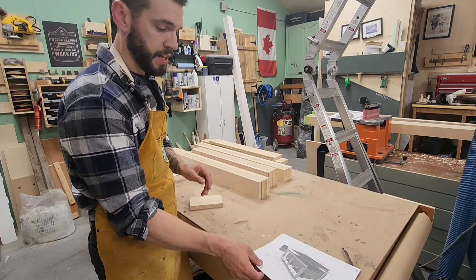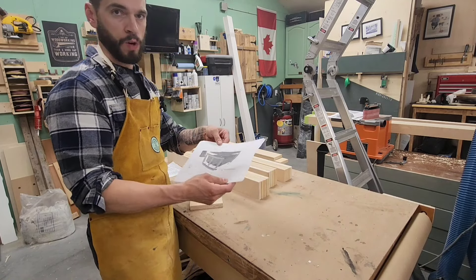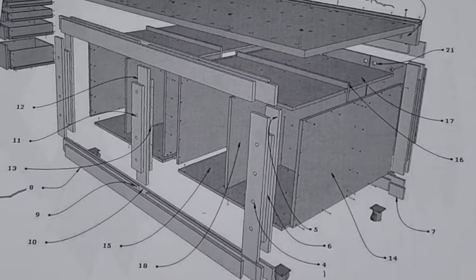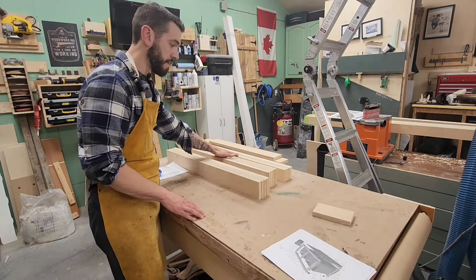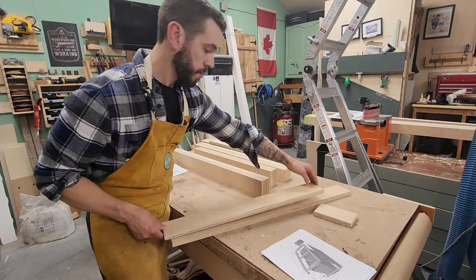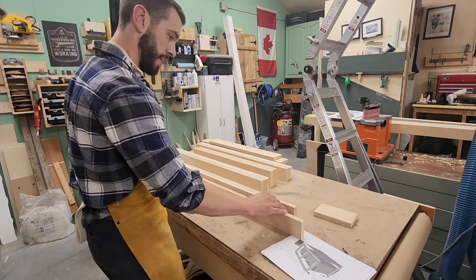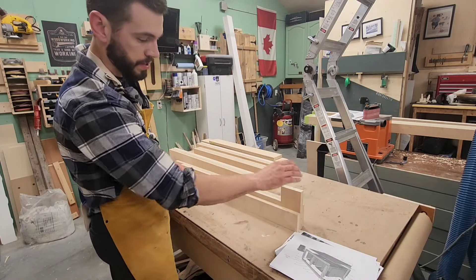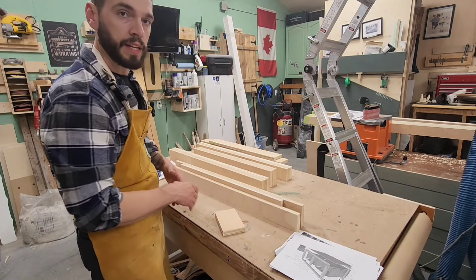So this workbench is not actually my exact design — it's actually from Suso over at ES Woodworking; I'll put a link in the description. I'm going with his workbench design, which is basically built up of material as opposed to taking material away. What you just watched me cut was the corner leg systems, and on those corner leg systems, each leg is comprised of three pieces of plywood to make up the singular leg. You'll have your long back piece, your middle piece, and your shorter inside piece. When it's assembled it will look like this, and then when we have the long rails that come across, it'll fit directly in this end groove and go across. The inside chamfer that you can see here is going to allow the interior boxes to sit inside, and you'll see all that as the video progresses.